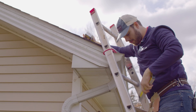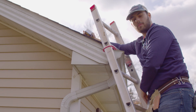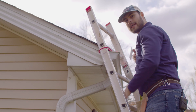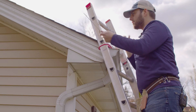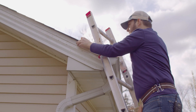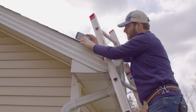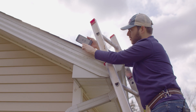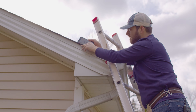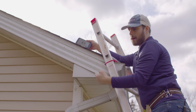You can also use smartphone apps to measure roof slope. You're going to need to create a flat surface using something. With your smartphone, it's pretty simple — it just gives you a reading based on the slope of the roof. Place it on the flat surface and there we go, about a 6:12 again.